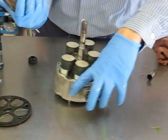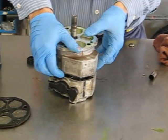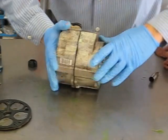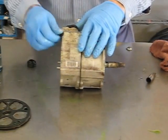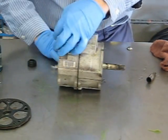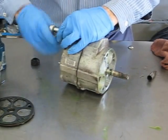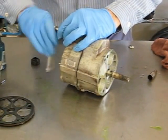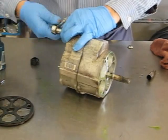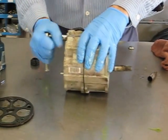Then take our case, hold your seal, and very gently work it down over the pistons. Just kind of catch it and slide it back together. At this point we can go ahead and put our two shorter bolts in and snug them up. You can torque these down now or just tighten them a little bit until we torque everything else. All these bolts should be tightened to approximately 23 foot-pounds. It's also a good time to take a look inside the compressor — make sure there's no burn marks and that the pistons aren't scored in their bores; at that point you'd have to replace the compressor.